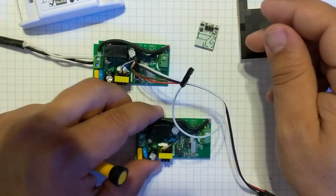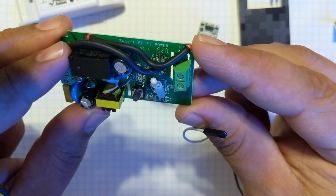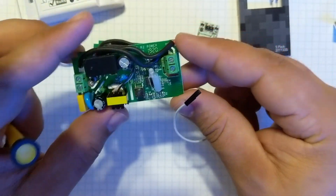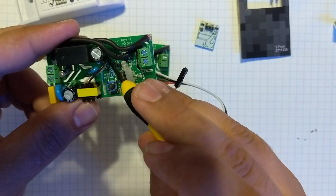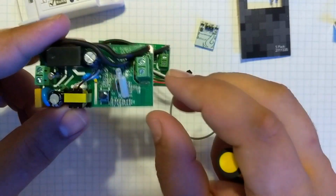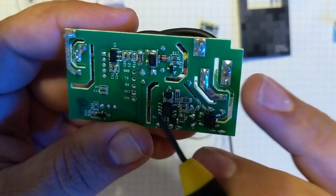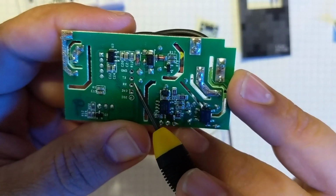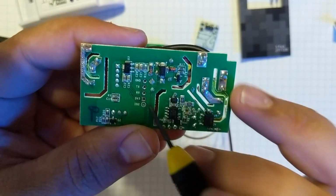So these Sonoff Basics are the RF-R2V1s. In that case, they actually don't have the fifth GPIO 14 pin over here, so we'll be using the 3.3V, RX, TX, and ground to do this.